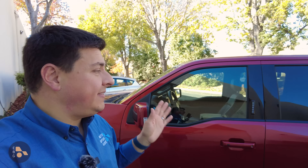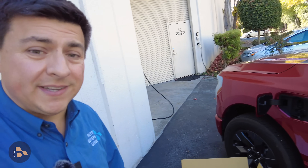Now the question: is it worth it? I would say rather unfortunately not in my case. A standby backup generator running on natural gas or propane would simply be more sensible for a lot of folks. This system can provide a reasonable amount of backup power, but if you need more — say 15 kilowatts, if you have two heat pumps, a larger two-story house, or want to run your oven — you might be able to do that with a standby generator for less money than installing the integration kit. I would probably simply stop at using this 80 amp EVSE, which will definitely make the Lightning charge a lot faster at home.